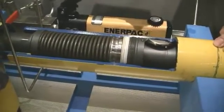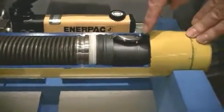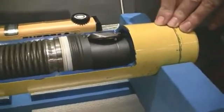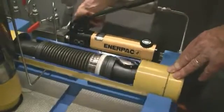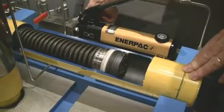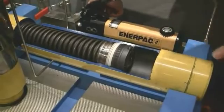The valve is now fully open. The flapper is isolated from the flow by the sleeve behind it. Now let's watch while I release the hydraulic pressure and close the valve. Observe the spring — the spring has now opened fully and the flapper has closed.